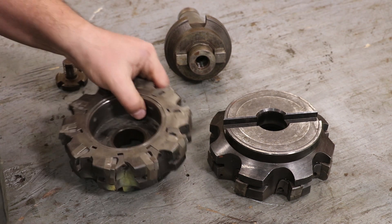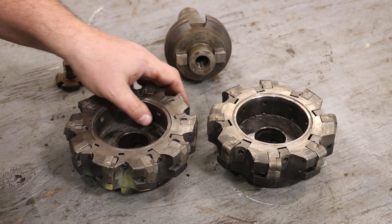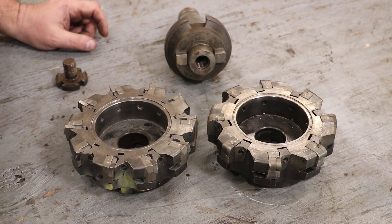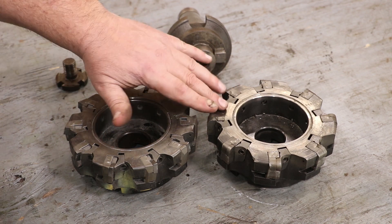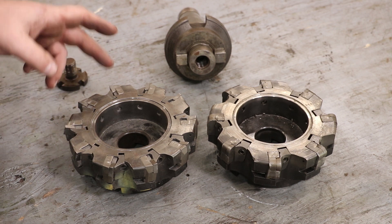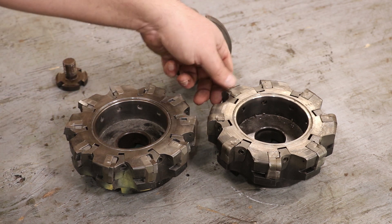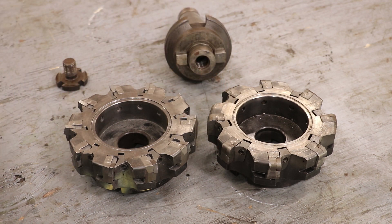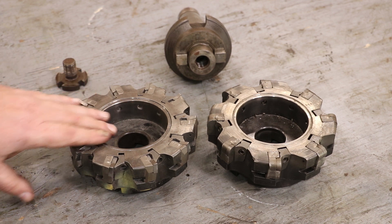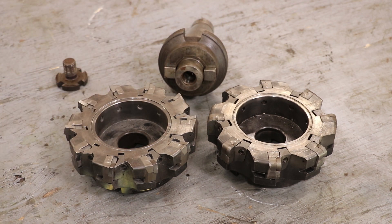They're set up for different types of inserts. This one here has a round insert on it, whereas this one has a square insert that's kind of turned up at an angle so you have a high spot. I'm going to be machining cast iron, and I really kind of like these round inserts on cast iron, but I think today I'm going to go ahead and get this one set up — mainly because it's just got more teeth making more cuts, and I really kind of like that point going in rather than a real wide face. So I think the first thing I'm going to do is take these over to the parts washer and get them cleaned up really well, because there's some dirt, grime, and grease on both the holder and the face mill itself. Then we'll start putting these together.